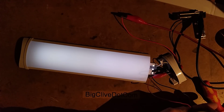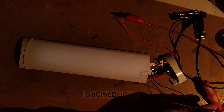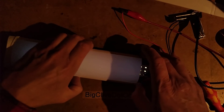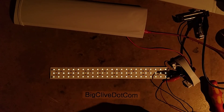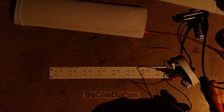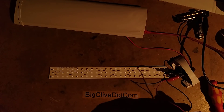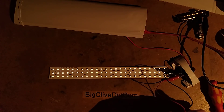I'm going higher — this is actually 33k ohms now in series and it's still visibly lit. Let me bring the LEDs out. This is the highest it goes to — one megaohm — and they're actually still visibly lit. That is ridiculous. So that's an interesting option.